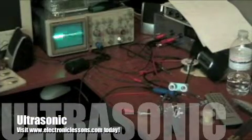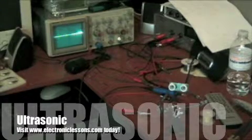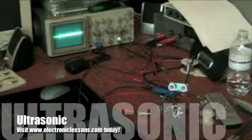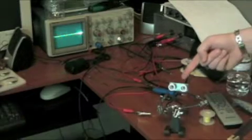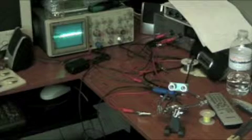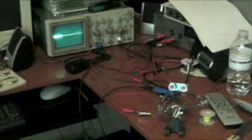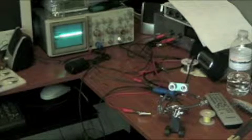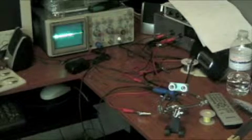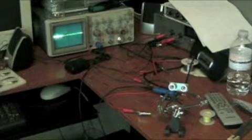What I've got right here is that it can be powered between 6VDC and 12VDC — so 6 to 12 volts DC. If you notice, I've actually got the transducer set right here. If you look in the back corner, you can see my oscilloscope scrolling — it's on a flat line. We've got 0V coming out of the output. Right now I've got about 9VDC at the V-plus line and the other line grounded. Again, 3 pins is all you have to worry about.